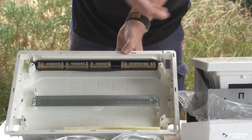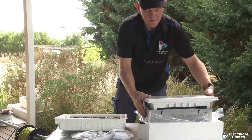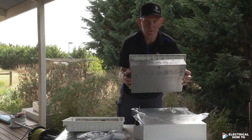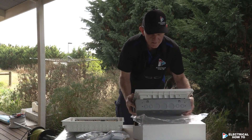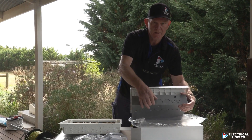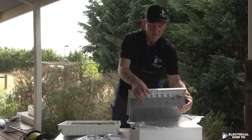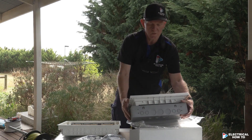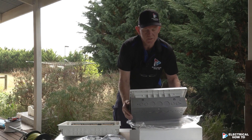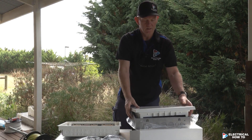That gives you an idea of what you can use between a Hagar internal flush switchboard or a Clipsal. The Clipsal already has a metal back on it, so it's nice and easy to install and can be earthed — and that's what you've got to do on all internal switchboards now. We'll also be running an anaconda conduit down inside the wall, knocking out one of these knockouts and bolting it in so it's all metal and earthed straight away. This is required because your sub-mains coming into the switchboard are not protected by a safety switch, so the anaconda and that metal must be earthed.